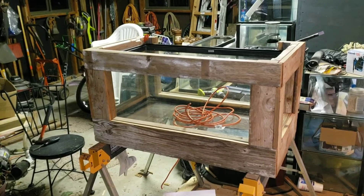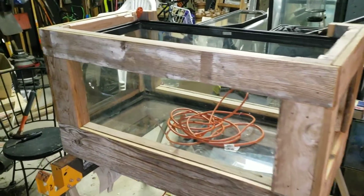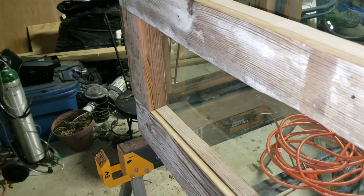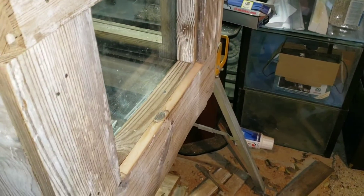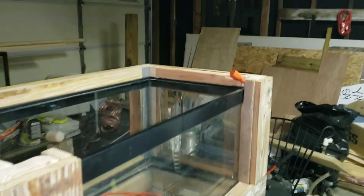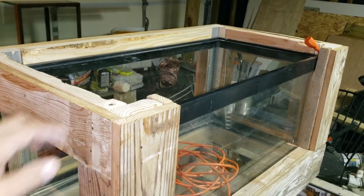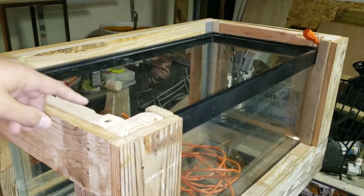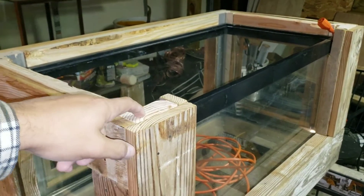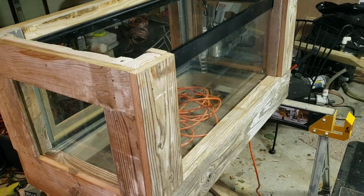Here's what we've arrived at for the finished product for the framing and trimming. I just used some barn wood — we ripped it down to size and trimmed the inside as well. The rest of this is made out of 2x4s and 2x2s. You'll notice I left the back open so you can slide your hand under to feed the fish. That's the only place we'll have an opening. We're going to put 1x4s across this all the way around, paint it, sand it down a little bit, put some felt, and the glass will sit right on top of that.